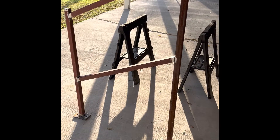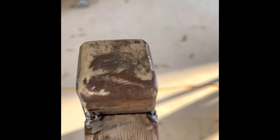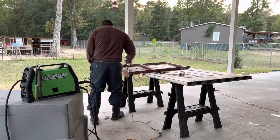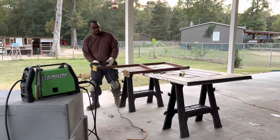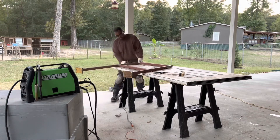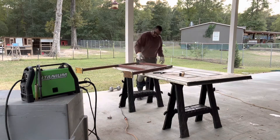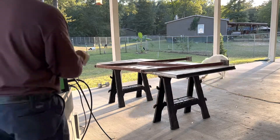This is how the handrail is looking so far — almost there. The top is covered, the other top is covered. What I'm going to do now is take the grinder and clean off all the rust so that when I'm painting I have good contact. I'm also cleaning where I'll be welding — cleaning off the area so I make good contact with the welding machine. You want to make sure you knock off all the rust, both for welding and for painting.